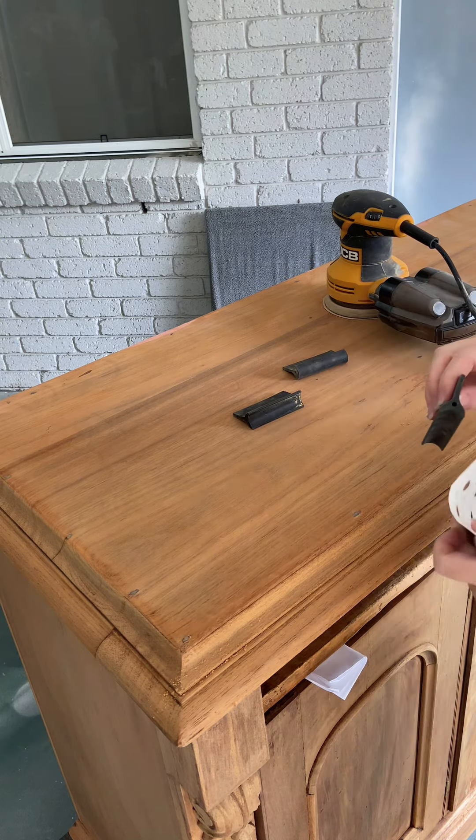After the paint wash application and a quick light hand sand, I was able to seal the whole piece with a water-based polyurethane. I chose a matte sheen so it looked more aged and authentic — like a waxed French country piece. Here is where we started and where we finished. The final result blew me away. Let me know what you think in the comments and check out more important details in the description. Thank you for watching and I'll see you in the next video.